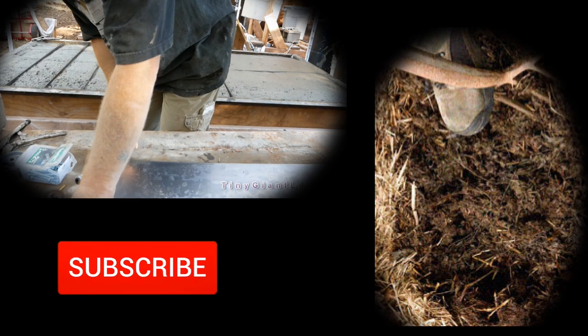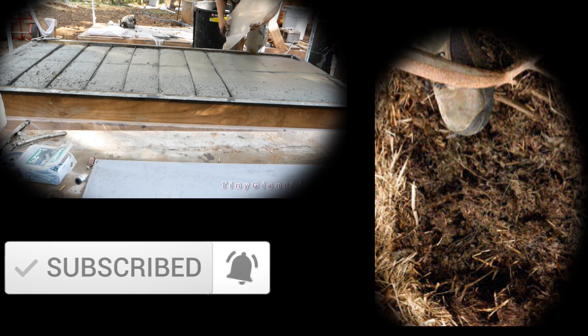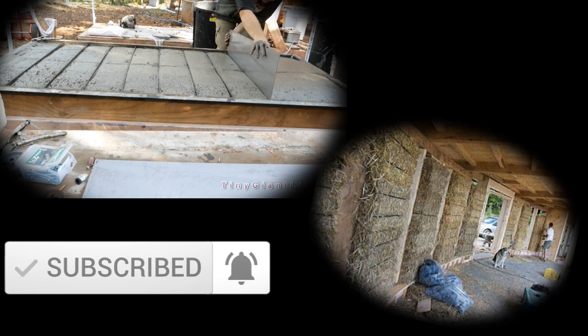When you're done with the house, it easily breaks back down into the environment — it's completely non-toxic. There are so many advantages to straw bale. If you're in a climate that needs heating or cooling, the insulation makes it an extremely comfortable house. You can build passive structures with straw bale using insulation and thermal mass. It works beautifully and can actually be done in pretty much any climate. There's a saying: cool them with an ice cube and heat them with a candle — and that's not far from true.